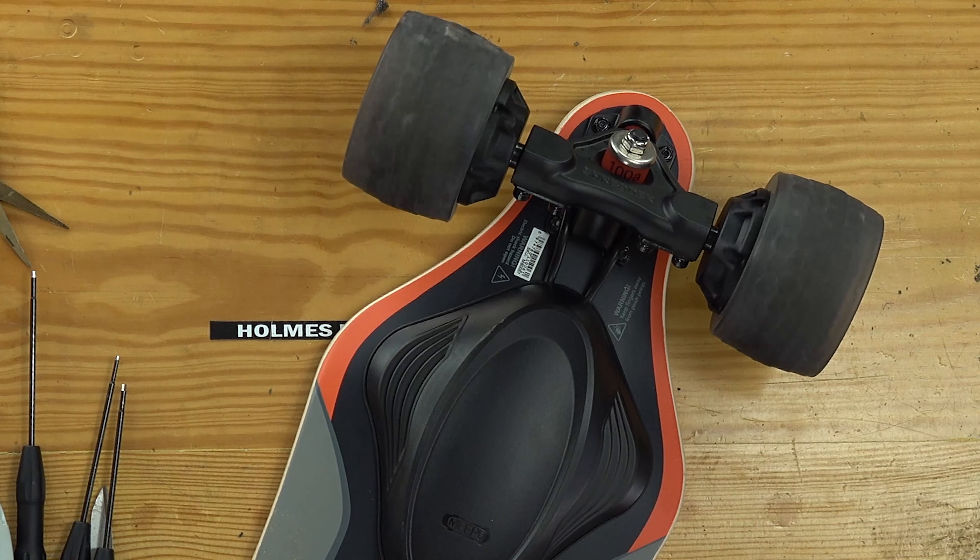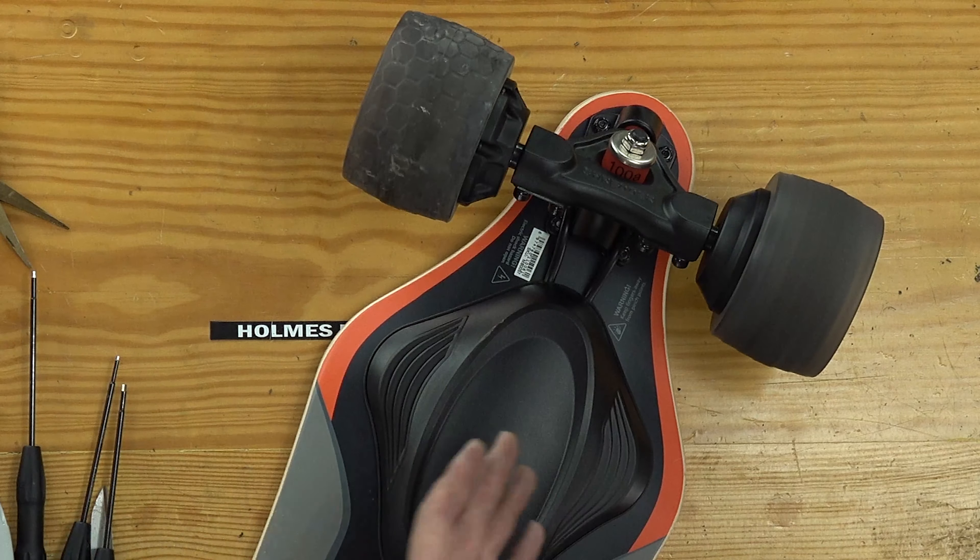There's really good low speed control — it goes pretty slowly at the low settings. There's not a lot of vibration in general. The ball bearings don't have quite the same amount of free spin on both sides, possibly from me fiddling with one of them. It appears to use a standard six-step startup — some call it FOC but these have normal five-wire sensor harnesses. It's more likely a sine wave approximation. Either way, it's silent with no audible switching frequencies and has excellent low speed control. Being a high pole-count motor, it also has extremely strong brakes.